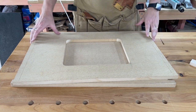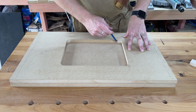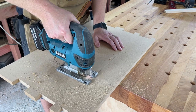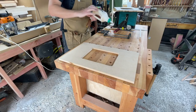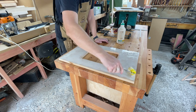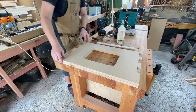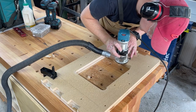Next up we're going to cut out the same hole for the insert plate on the bottom piece of the table, but this time we can use the top as a guide. I use the top to draw the rough position of the hole and then use the jigsaw to cut it out. Just like last time I'm not going right up to the line as I'm going to use a router to clean that up later on. With the hole roughly cut it's time to glue the two pieces together, and instead of clamps I'm just going to screw them together as well, being careful not to put screws anywhere near where I want to put T-track later on. When the glue is dry I can use the same flush trim bit to clean up the bottom hole.